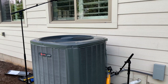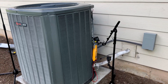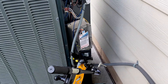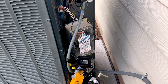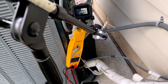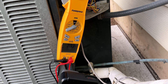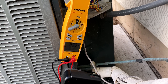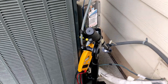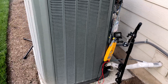There you have it — the full startup sequence. It's sure been awesome to have. It's made a tremendous difference in being able to run this unit off generator power, and I think it just helps with some wear and tear on the compressor — being able to reduce that startup inrush down to just 23.3 amps is awesome.